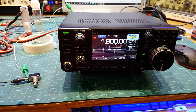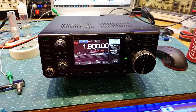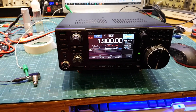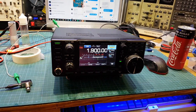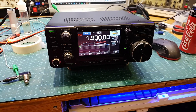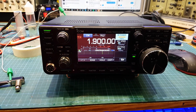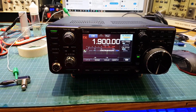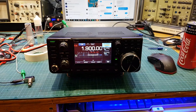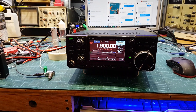I got a phone call the other day from a person that owns this radio in an awful state. I think this thing is only a couple of weeks old. Long story short, he got into a bit of a flap because he wasn't seeing 100 watts on the meter — he was seeing 95. This thing is wide-banded, so he'd seen a video on YouTube where a fella goes into the service menu, which is a hidden menu. You go in using a shorted-out 3.5mm plug that you put into the remote socket, and you press menu and function and turn the radio on, and it brings you into this menu.